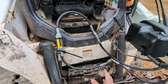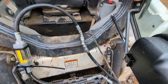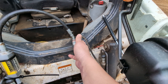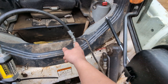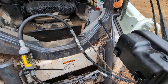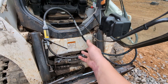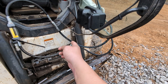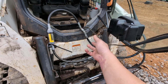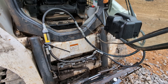So that's the answer: can these handle 9, 10, 12 gallons per minute? Certainly. The 4-Series uses this coupler on the front third function — if you use a grapple or an auger you're moving 11 gallons a minute through it. John Deere, and other brands, have no problem putting that on because they know you're not going to use it in a fashion that creates enough heat to become a problem for the overall machine.